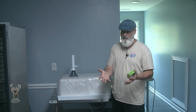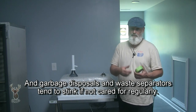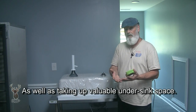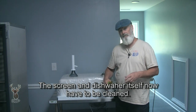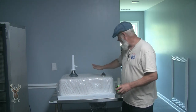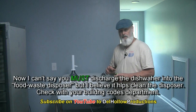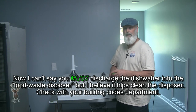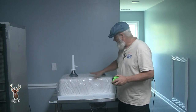Now if you have a waste separator — a basket that goes under your sink — that's equivalent to the dishwashers like Bosch that don't have a garbage disposal. They'll have a screen and catch that gunks up with food that doesn't dissolve, and you have to change that screen to keep things from smelling. The garbage disposal will need the port in it where we put the dishwasher discharge. That mechanism is sink-mounted, takes up space, and has to have a drain — so you have to plan for it.